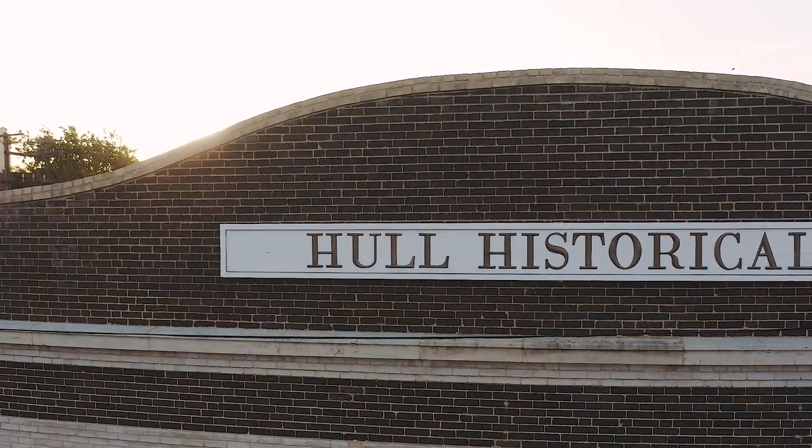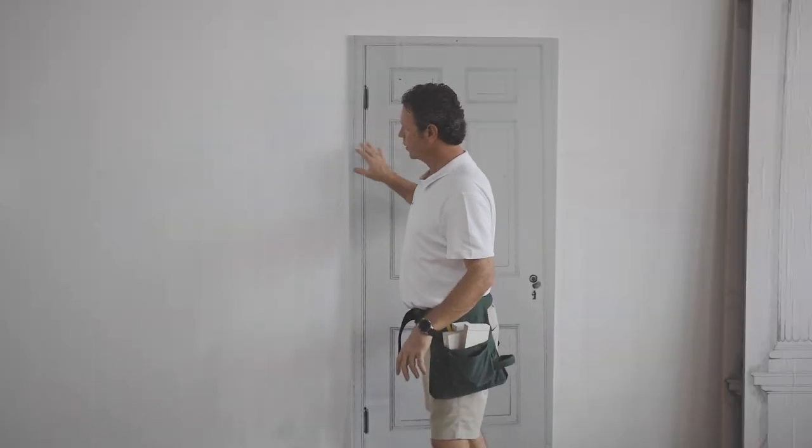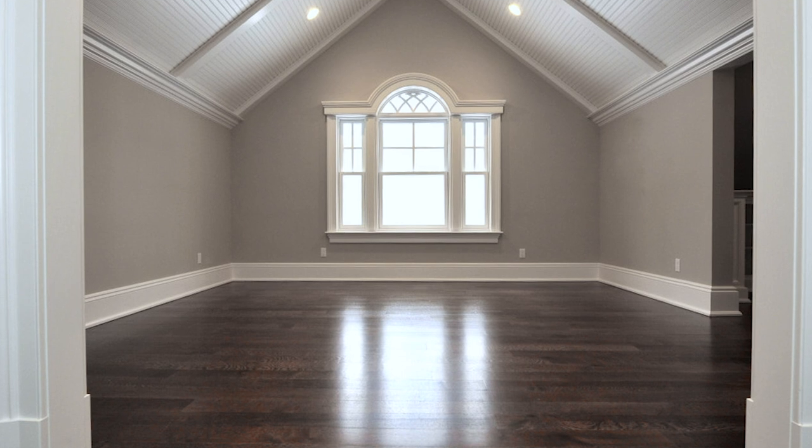Here's what we've got here, guys. We've got a little studio here where we've got a faux wall, and I'm trying to put moldings together so that you can understand how they work together, right? The proportion, the scale, the hierarchy. And we're gonna elevate some areas. You're gonna see how the crown goes in, but I've got my door. I'm gonna put a window in here. We're gonna start with the base, then we're gonna put a chair rail in, and then we're gonna put a cornice and a crown in there. And you'll really see how this room, starting as a bedroom, right, elevating to a very formal space, all based on the type of moldings that we put in.